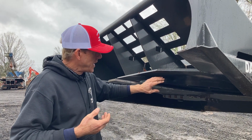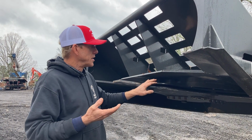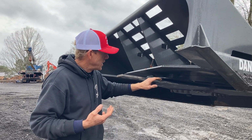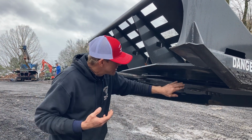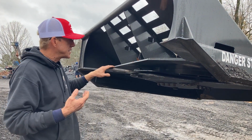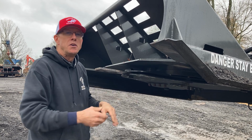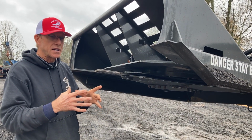So, all right, heavy carrier versus light carrier. This can work in the field or it can work in the brush. It works in the brush by having this large, heavy blade carrier and these heavy blades. All that inertia is up to speed. That's what's going to help it power through big saplings like that.